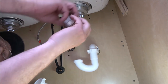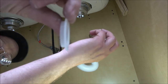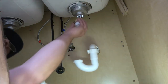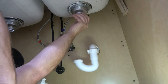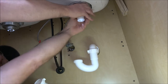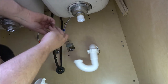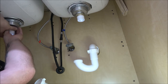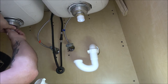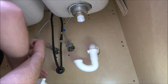Here's the piece that goes up on the drain — it's going to take one of these tailpiece extensions that comes with it. This goes in here, this goes in here, and we're just going to screw it up on here. Do the same thing on this side. Don't forget the friction ring. If it feels like it's going on tight, turn it backwards and then forward to get it started right.